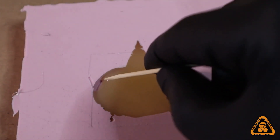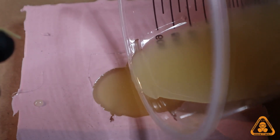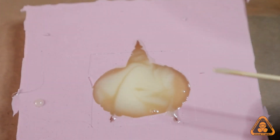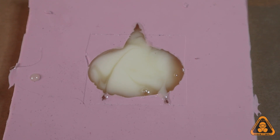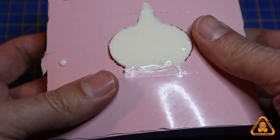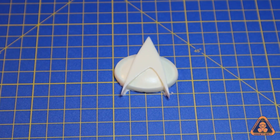Using a soft tool like a toothpick or brush, make sure all the tight spaces are free from air bubbles and properly coated over the surface. Air bubbles in the body of the resin don't matter — just not on the surface where they'd be seen. Already the resin is turning milky white as it cures, meaning it's too late to do anything but wait. This takes around three to five minutes, but leave it longer to make sure it's properly hardened. To check readiness without risking damage, check the cup the resin was poured from. Only when it's hardened and completely cooled, slowly pry the silicone away to save the mold for multiple uses. And there we have it — a successful mold that's created a perfect cast.